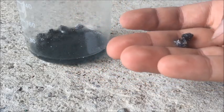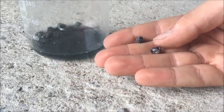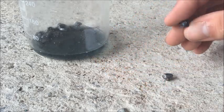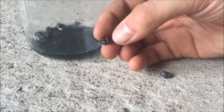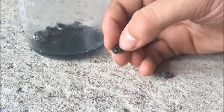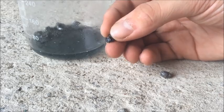The pieces broke up during sanding, so they're not all that together. But I'm getting some really nice metal here. This piece is pretty much a solid bit of metal — I've still got a lot of slag to remove. You can see here how there's a whole lot of slag around the outside, and right in the middle there's a nice sort of rectangular piece sticking out. I can pull all this black mass away and just get this little nice piece, and you can get that iridescence I was talking about at the very start. So that's vanadium metal.